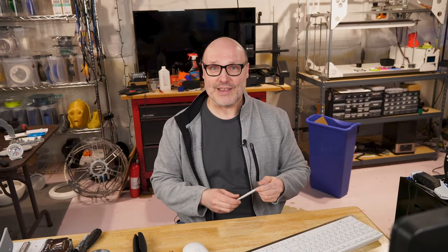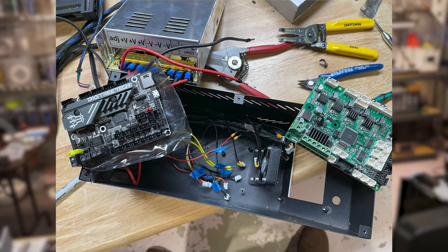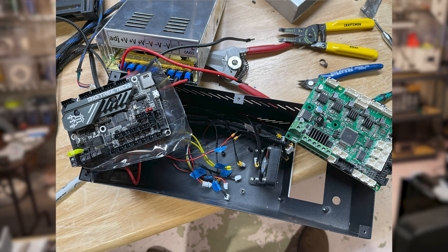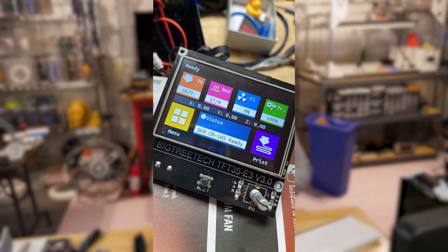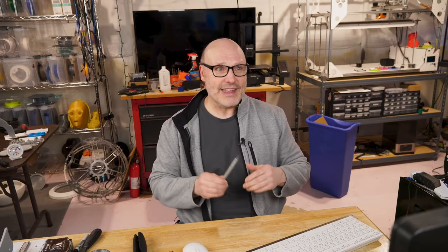These things have been excellent. I also upgraded the electronics — I got rid of the noisy stock fans, got rid of the stock power supplies, and upgraded to the Bigtree Tech Mini E3 V3 with 2209 drivers. I also got rid of the stock touchscreen and put in a new TFT35, also from Bigtree Tech. I think that's about it for the upgrades. With the print volume, it works great, and having three of these configured differently has been excellent. With all the upgrades — build surface, electronics, and direct drive system — it's been way more reliable than stock.